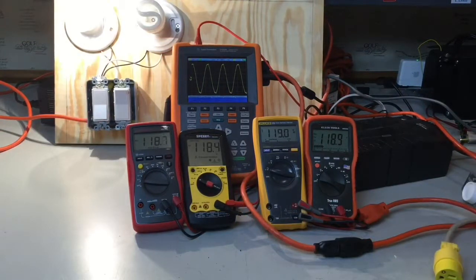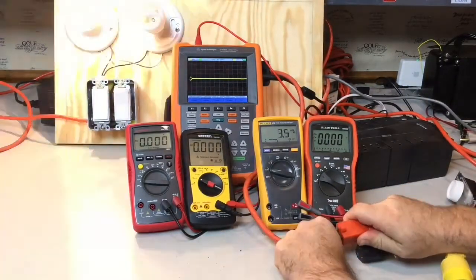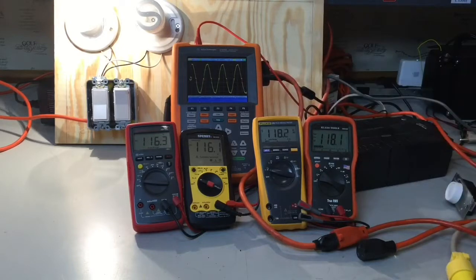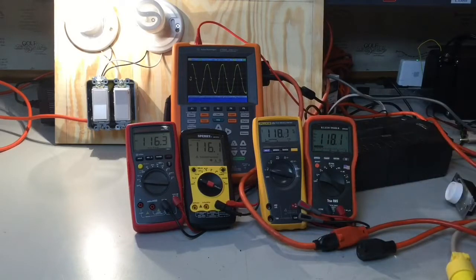So when are you going to see a voltage that is not a pure sine wave? Well, you would if you were using a light dimmer. Let me unplug this AC signal coming straight from the line and plug in this dimmer switch. Now you can see the dimmer is full on right now and already my sine wave is not nice and clean — you can see some noise happening in the sine wave. Now instead of measuring the same between my true RMS and my averaging meters, I've got about a two volt differential because of that little bit of noise.